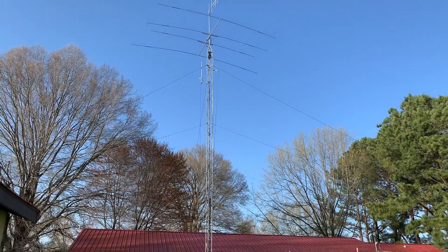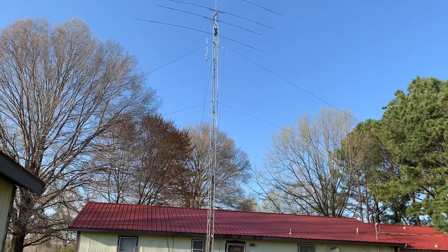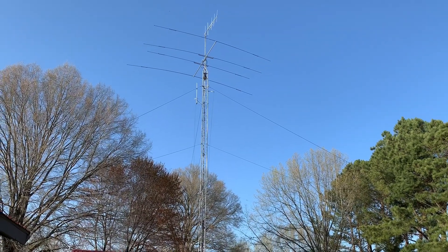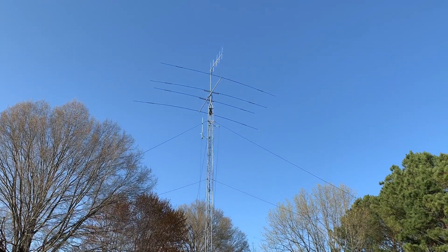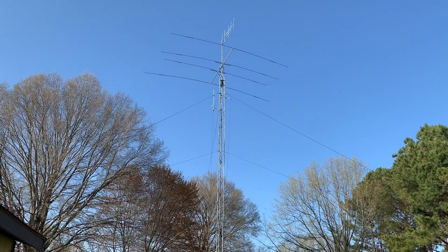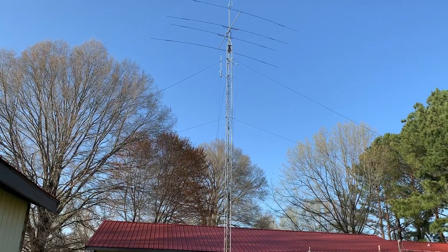It's been a very long but productive day here at WD4PTJ. We got the tilt-over tower finally put up — a project long overdue, but it's up now. It's got a Mosley TA-33 tri-bander up top, three elements. There's also one element that's a TA-33 Junior, plus one element for 17 and 20 meters — just a rotatable dipole — at 50 feet. Up at the top of the mast, about seven feet more up, is a Cushcraft A-270-10S beam for two meters and 440. And off to the side of the tower is a Cushcraft AR-270 ground plane for two meters and 440.